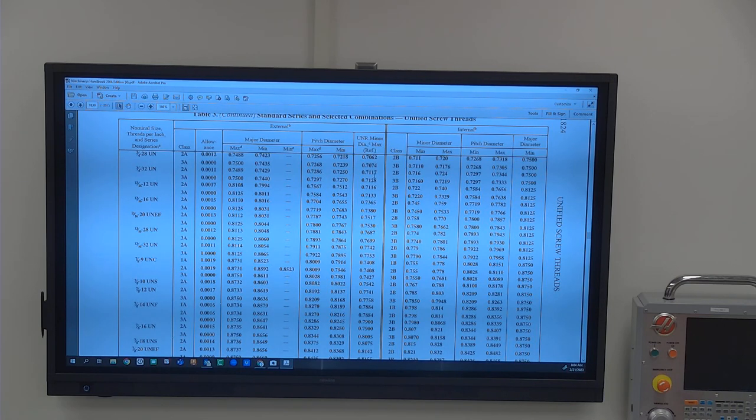All right, if I'm going to do a 7/8-9 2A, what is my major diameter? The 7/8-9 thread is pretty coarse on the pitch. So what would you turn the outside of that part to? Anywhere between those two numbers? Right. I would try to find the nominal in that. So on the 7/8-9, we got .873 to .852. If it were me, I would try to find something nominal to it as well as a normal number. So probably .865 would be my number on that middle.